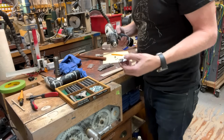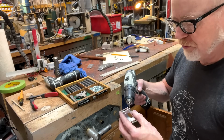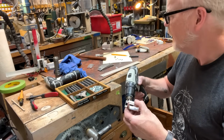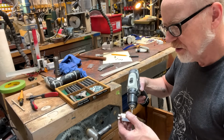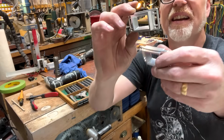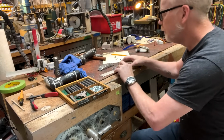The first tap I used had a spiral point. This is a flatter bottom tap, so I'm just making sure the holes are threaded as far down as I can get them. It was less critical on the long data display, which has more meat. But I'm going to do something tricky with this pair of data displays. Since these guys live one above the other, I'm going to cut a single piece of aluminum.